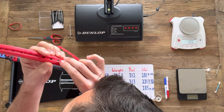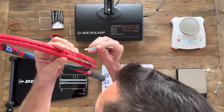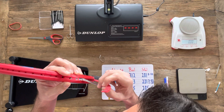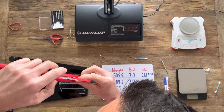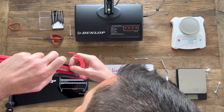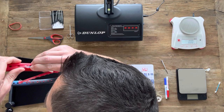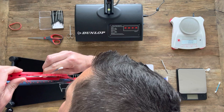I'm not using gloves for this installation since it's tedious to get the lead exactly where I want it, though using gloves is a good idea whenever possible. I pick a grommet hole as my guide for where to start laying down the lead strip, then use a Q-tip to press the first inch or so of the strip into the channel to anchor it so it doesn't move as I work the rest in. I then center the strip over the channel, push it down lightly with my finger, and once it's centered, press it firmly the rest of the way with the Q-tip. This channel is narrow and deep, so the Q-tip is essential here.